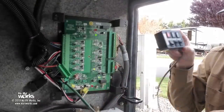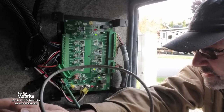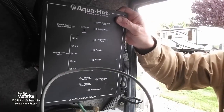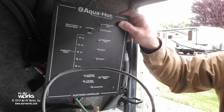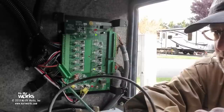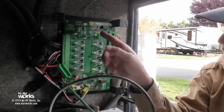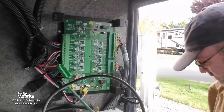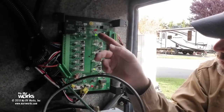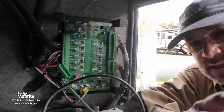I've got my light. It's doing its pre-purge — if I'm quiet you'll hear the gas solenoid click. My lights are telling me that my diesel burner status is on and pump three is on. Pump three is our stir pump — you want pump three on whenever the zone pumps are not on. The heating status light is on, it wants to heat, but I'm not hearing that deep roar. As the customer stated, it's not igniting.